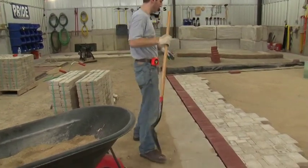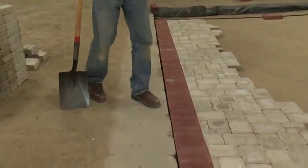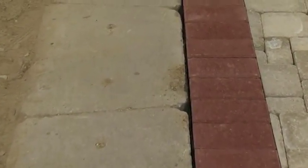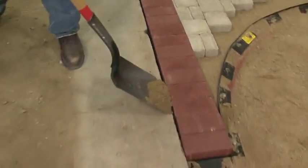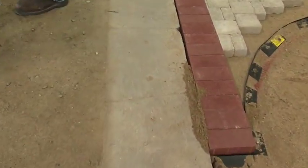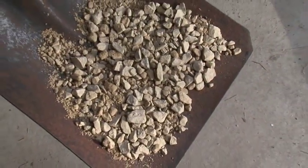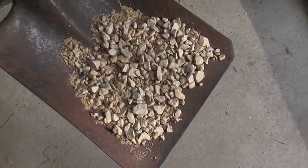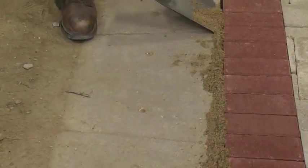When we have a void like this, it's important that we lock this in at this moment — otherwise when final compaction happens, the whole pavement will shake back out until it's tight against the curb and all of our bond lines will go out of alignment. So we'll take a little bit of sand and just start filling those voids. If the void is large between the soldier course and edge restraint or curbing, use the largest aggregate available on site to start filling the void and then finish with coarse sand. This provides a structural lockup of the void and prevents washout better than just using coarse sand.